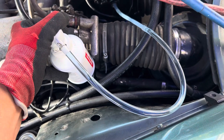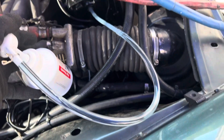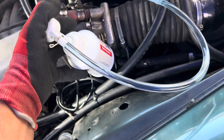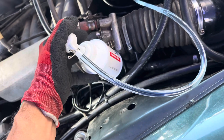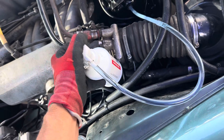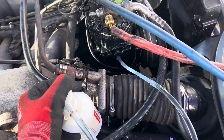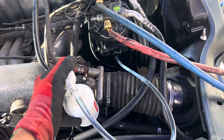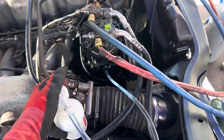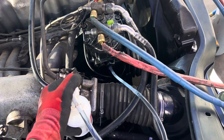Very simple - I never exposed it to the air other than what was just in this little tube here, and I had nitrogen pushing backwards through the tube so the tube was purged. The foil seal was never open to the air; I just punctured the pickup tube right through the foil seal and screwed it on, and there's a constant purge flow of nitrogen. After spending all that time yesterday drying out the system, just before opening it - because it was under vacuum - I put nitrogen at two or three PSI pressure when I took that drain plug off.